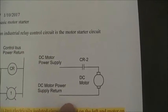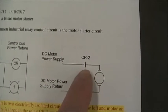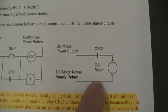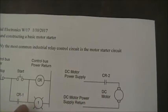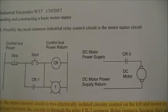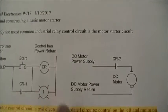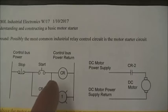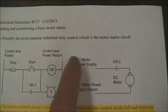So if we have 2 volts across the LED and a 12-volt source, that leaves 10 volts at 10 milliamps — around 1k ohm for that resistor-LED combination. In the controlled circuit, we're going to use a little motor and a separate contact from the relay — CR-2, the second set of contacts. We can use single-pole single-throw or double-pole double-throw relays. Since we're going to use two independent contacts, we'll use a dual double-pole double-throw relay. The control side and the motor side are completely independent — that's one of the great assets of a relay: physical and electrical isolation.